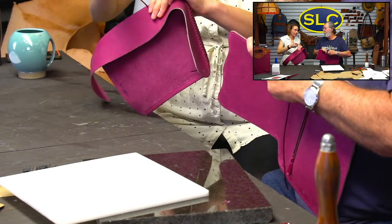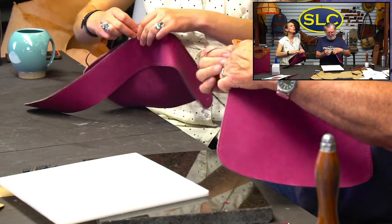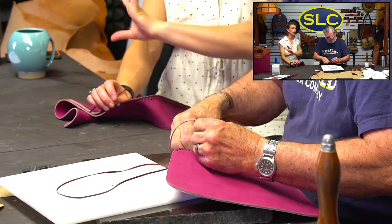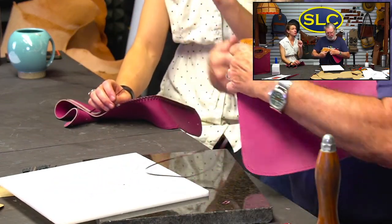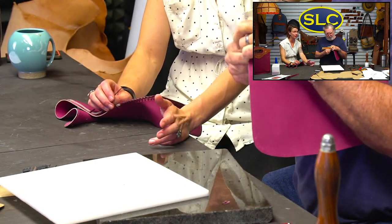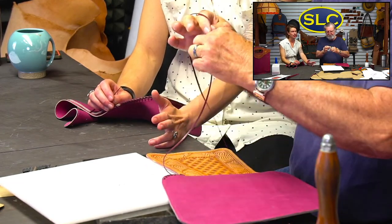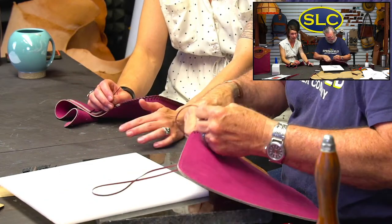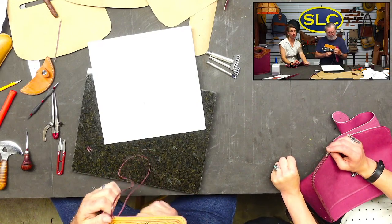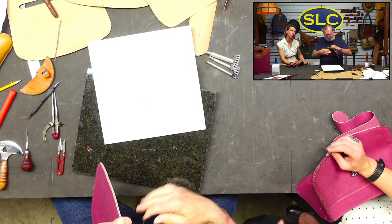That's all I got. Okay, let's see here. Little Fear asks if 21 is the heaviest stitcher. No, 20. So when you're talking about the class 3 and the class 4 and the King Cobra and your heavy stitcher machines, size 21 needle is the smallest needle. And everybody wants a size 21, so I assume that maybe they can sew 69 thread, which it's really not made to do. We've just suddenly, like the last 6 months, had a ton of requests for size 21, and I really don't understand why people with class 3s and 4s are wanting to sew with a 21 and a really small thread.